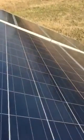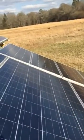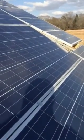The panel is actually pretty rugged because I was able to screw it back down using washers to the wood and got it working again no problem. I have these two large panels in series, then in parallel with the others, and the four 100-watt panels are in parallel with each string. They all come into the combiner box here.